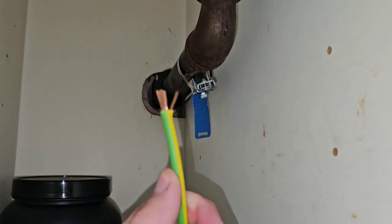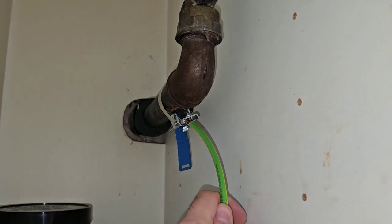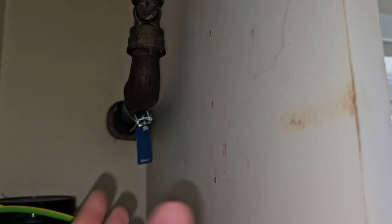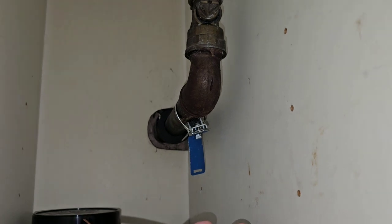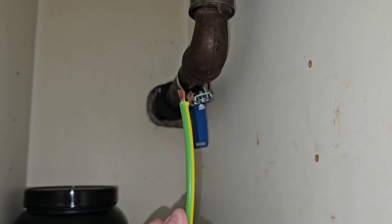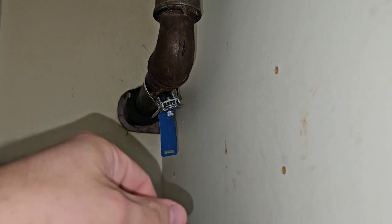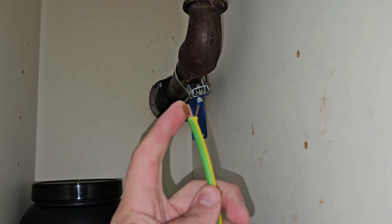Let me show you that earthing connection that Octopus left. When the gas meter was taken out, this is how they left my installation — in an unsafe condition because it isn't tagged. Realistically I'm not likely to touch this as it's buried in the cupboard, but it's not great. Plumbers seem to think this is just something that gets in their way, so they quite often just remove it. When you're doing your EICRs, you do come across these sorts of things — the easiest fix is to just pop it back on.